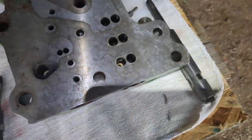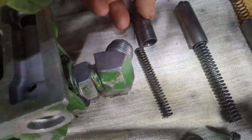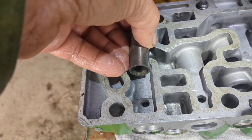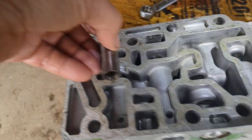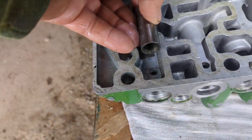It really helps me when I'm working on something to see visual pictures of what's going on. One thing I found: this last piston here — I haven't taken time to look in the book to see what it controls — but it's got that spring in there to hold it up, and it was stuck in that cylinder. It wouldn't go up even under the spring pressure.